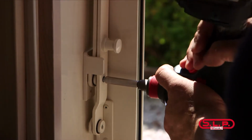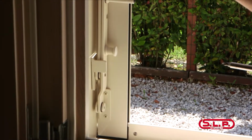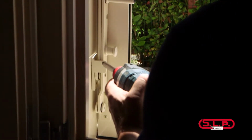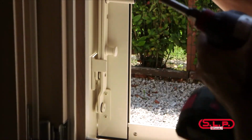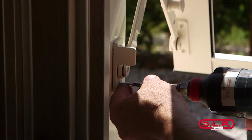Connect the arms to the guide and fasten them to the wall through the central hole. To prevent the arms from clattering against the guides, move the upper part of the nylon rest arms slightly forward, then complete installation.